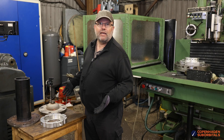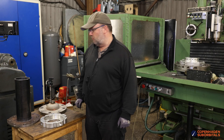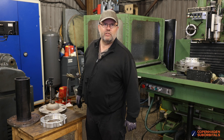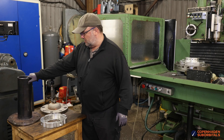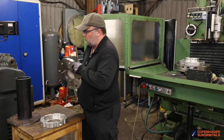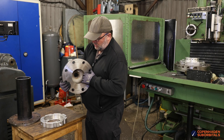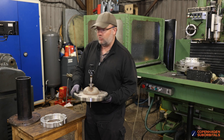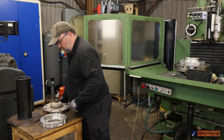These items here may be a little heavier than they had to be, but there were a number of industrial components that were readily available off the shelf, and since mass doesn't matter in this case we just took what was easiest to work with. The engine pipe itself is already done — that's essentially ready to use. Then we found a very nice large industrial stainless steel flange, a very heavy piece of equipment, and we experimented on some of the welding techniques we're going to use for the BPM25 engine anyway, and then we made the lox dome. Those two are both done and have been for a while.